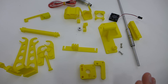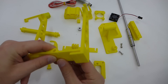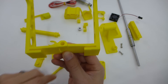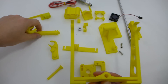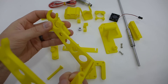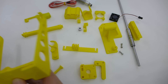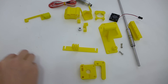We have a whole bunch of parts here. This is a new spool holder that clips onto the back side of the printer — it just slips in and there's a little pin to hold it. It's friction fit and weighted down. The arm it comes with works, but for larger standard-size spools they're too close. I have these little modifications that press right in and bring it out almost an inch, so larger spools can clear the side of the printer.